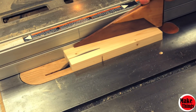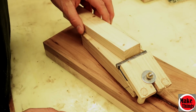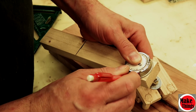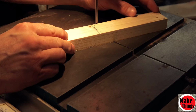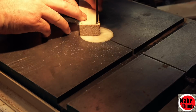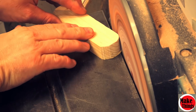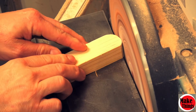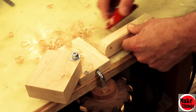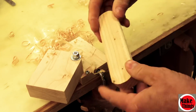Now that the mechanics of the pole block worked, I moved on to the handle. The width I used was about 1 3/8 inches. I found a lid to pattern my edge before cutting it on the bandsaw. I used my fence clamp here to plane down the edges, although I probably should just use my belt sander. Sometimes it feels good to go back to the caveman era of woodworking to appreciate our power tools.